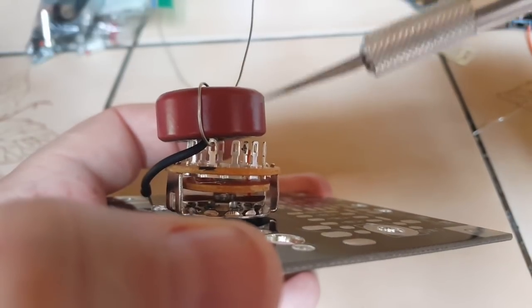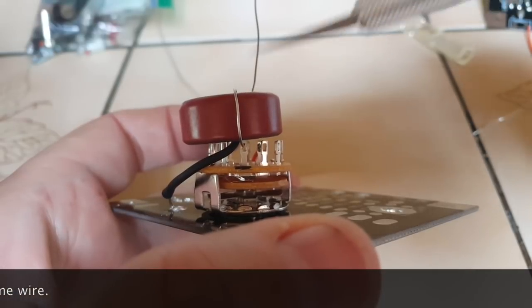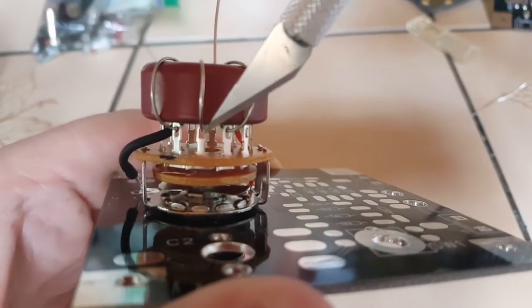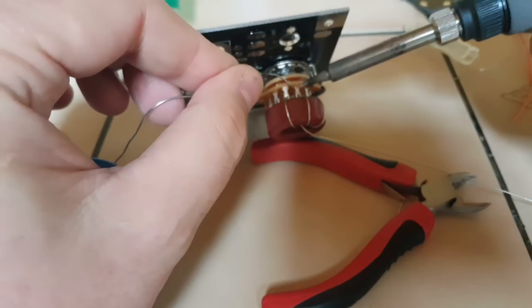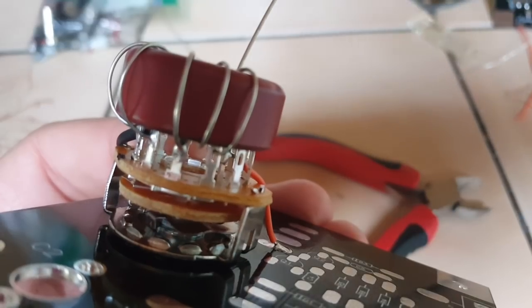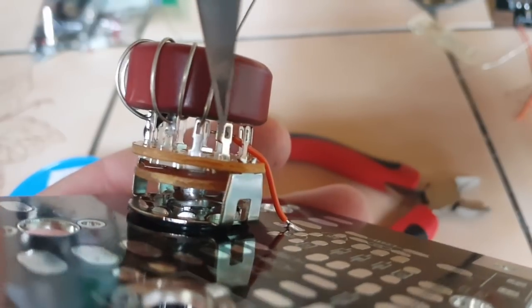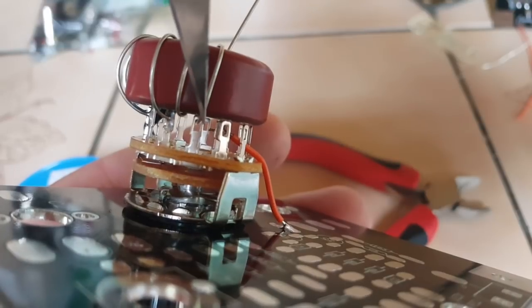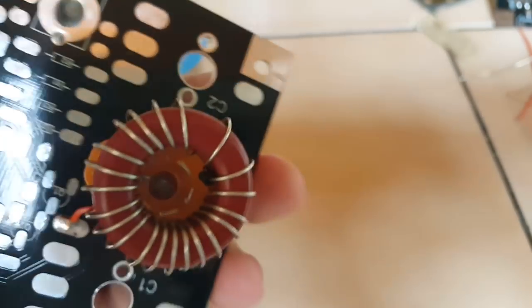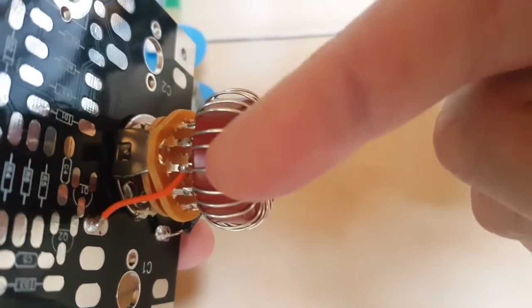I'm going to make three turns here. Make sure the wires don't touch because this wire is bus wire and it's not insulated. Here are the first three turns that go through the first three lugs. After that it's going to be two turns per lug. Turn number four doesn't go through the lug but goes in between — you have to make sure it doesn't touch the other wires. This one's going to be soldered on this lug. I repeated the operation until I was done with all the turns, and now I have to make sure they don't touch each other. If I had some hot glue I would put it around here to avoid the wires moving.